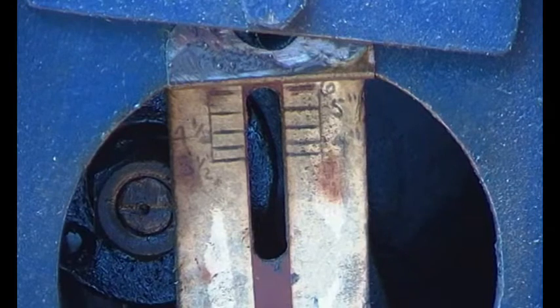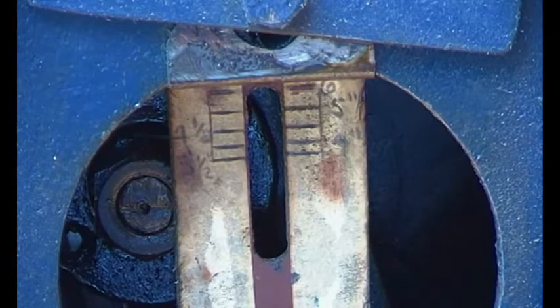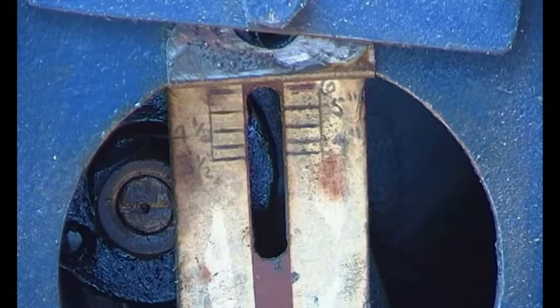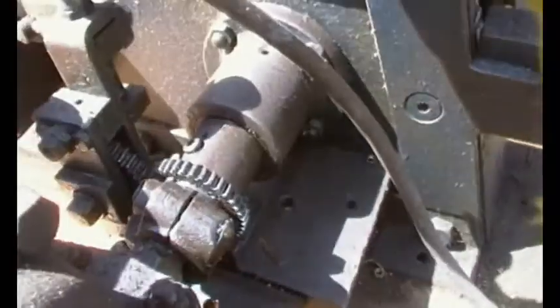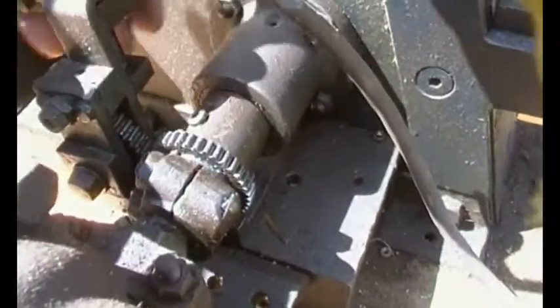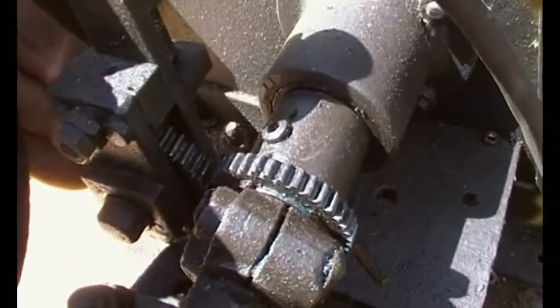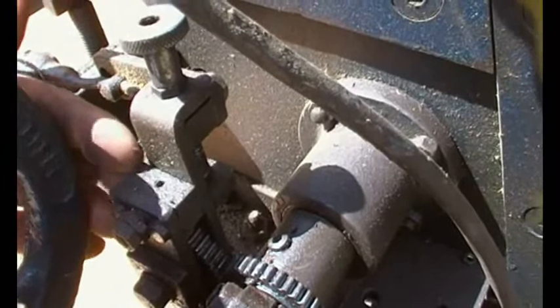But the fascinating thing we had when we were in Uncle Harold's workshop was the traversing drive. And now we're out in the light, and there's really only one reason why this is here and not in Harold's workshop — but it comes to us all. So let's have a look at the traversing drive. That's the gear we were looking at, which is on the primary drive and on the crank. And next to it, there's another gear — and that's an idler gear. And it drives this here. So this is a form of a crank; there's a pin that sticks out the back of this idler gear that drives this. As this gear wheel rotates, and because the pin is offset from centre, it makes this move backwards and forwards.